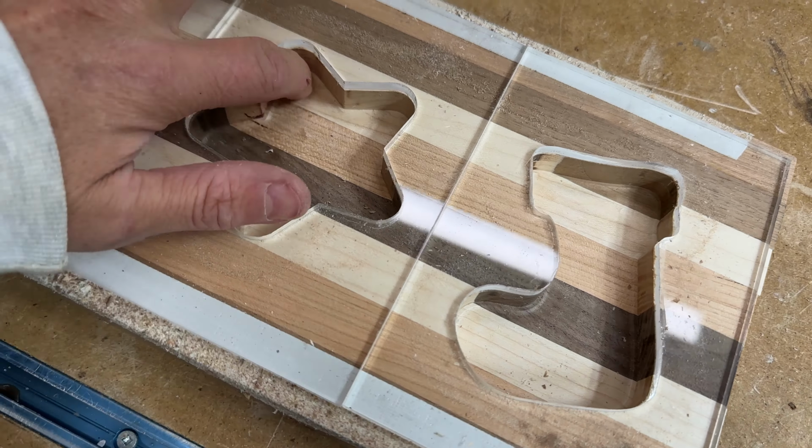Once they're all cut, align the pieces and add painter's tape to the side that will be on the outside. And then flip all of the pieces over carefully. Now you can add glue to the grooves and then roll them all together to connect with a final piece of tape.